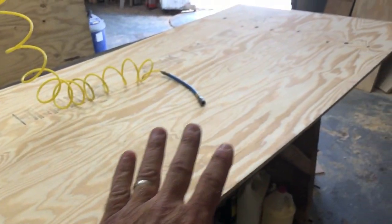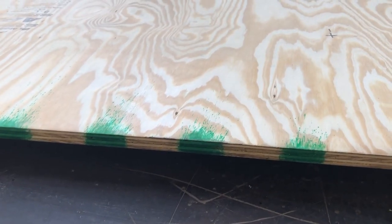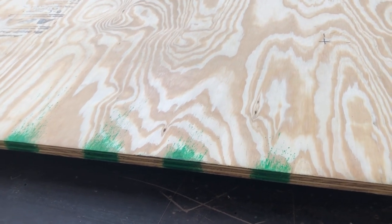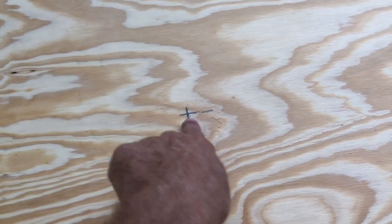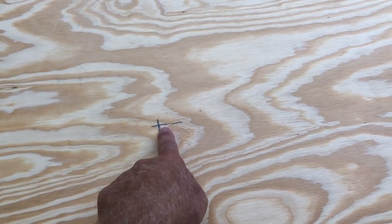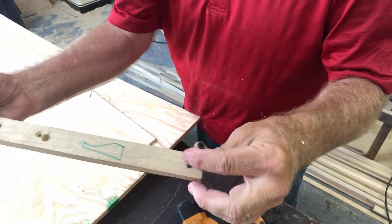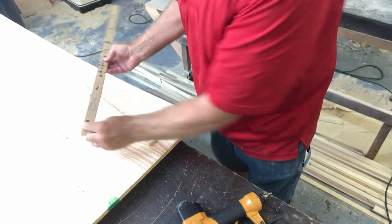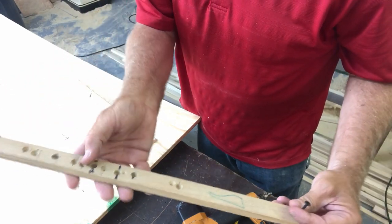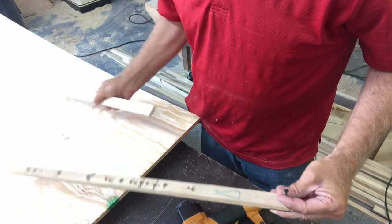I've got a full sheet of plywood because I'm building four of these — it's about five-eighths inch thick, and you can see the four green paint marks on it; this is from Lowe's. What I've done is mark 11 and seven-eighths from both directions, and what this does is give me a center for my 23 and three-quarters. This is a little homemade compass where I put a screw here, and I've got different holes set for different sizes. I've got one for 24, but not for 23 and three-quarters, which is an oddball anyway, so I'm just going to custom make my own.